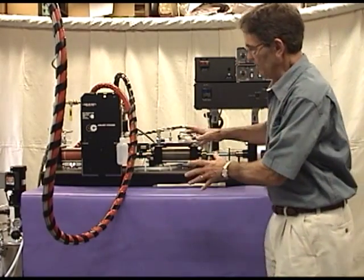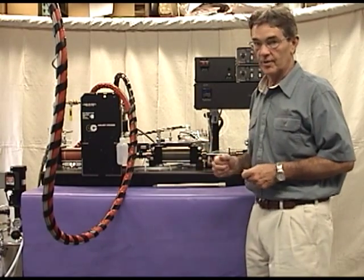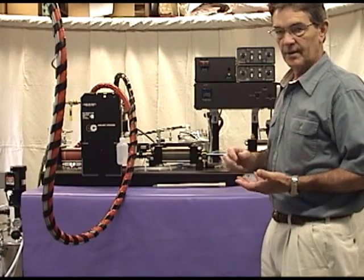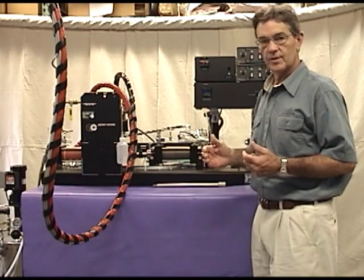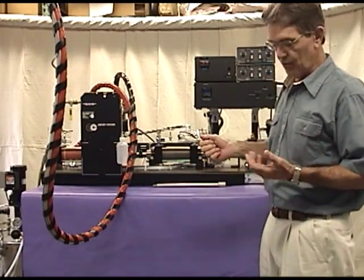The material this machine is processing is about a 100 to 12 by volume ratio. The resin side is heavily filled and high viscosity, while the catalyst side is unfilled and has a watery viscosity. There is quite a disparity in the viscosity of the two materials.